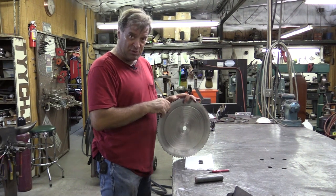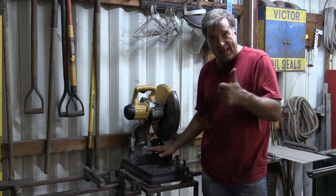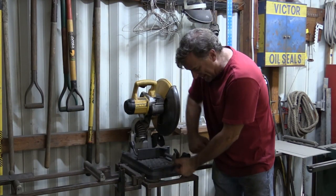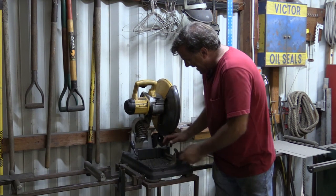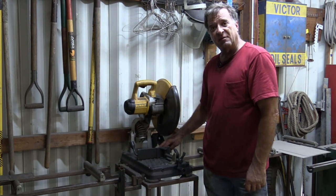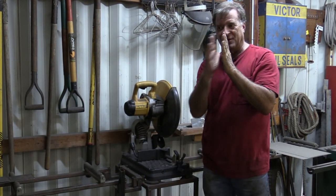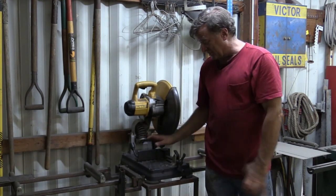It's a great tool — use it properly and it lasts a long time. It's really critical that you use the clamp. Put your work in there, slide it in, make sure your lock goes down so you can crank down on that piece and get it snug. You don't have to use a cheater bar or try to crush it, because then you're putting so much pressure on this clamp and backstop that you're actually bending the table in the back. That backstop, instead of being 90 degrees to the table, gets pushed backwards and your metal has a chance to come flying out. They have to be parallel to one another. This part has to be tight in the back — there are set screws to lock things down so this doesn't move at all.